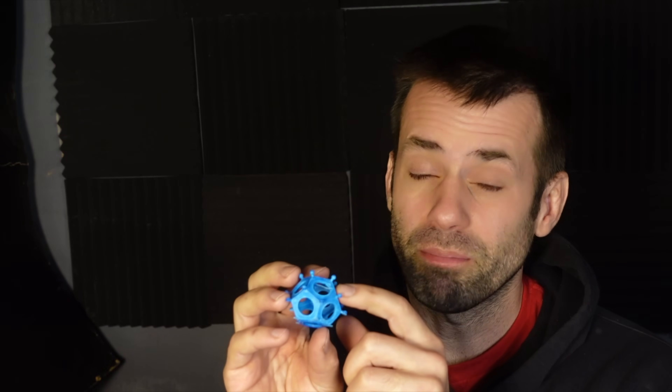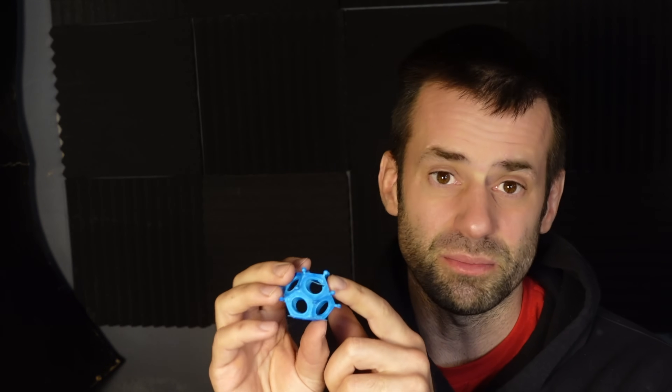Anything really delicate is hard to get to print properly. There's even one spot in the main body that is cracked — it didn't print properly. I know one key for the resin is to keep it warm, so I keep a space heater blowing on my printer. But even still, it's not an easy resin to work with, in my opinion.